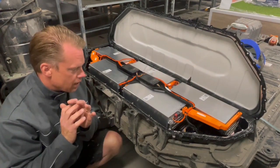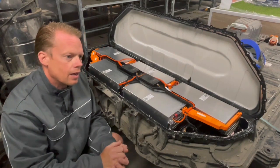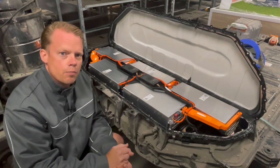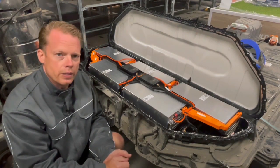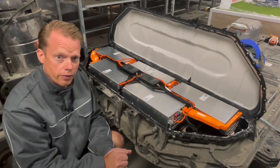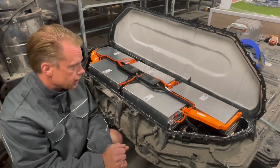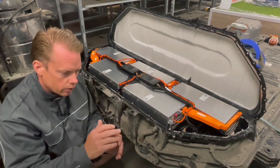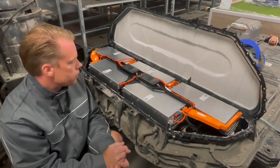So that's why I am going to run this on a 15S configuration. I also think it will be just perfect because I will have a little higher voltage and also a little less power loss — there is always better with higher voltage. After that, I will of course buy another BMS that will take care of all the balancing and stuff. But just for testing, I will not care about cell balancing at this stage.